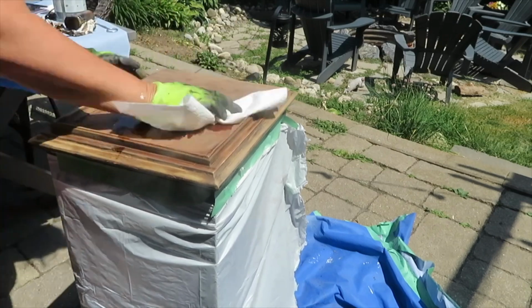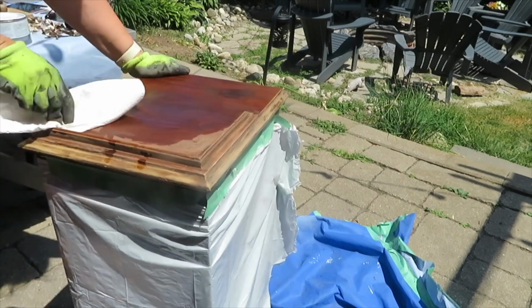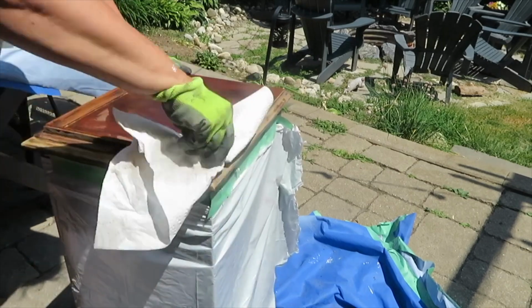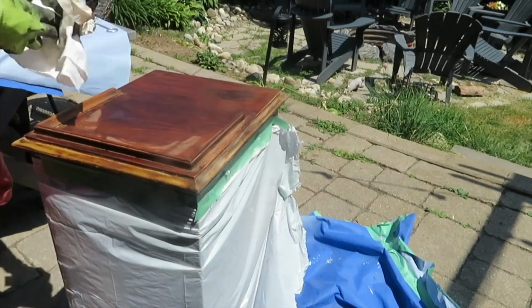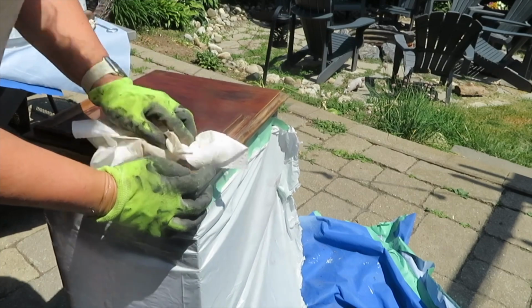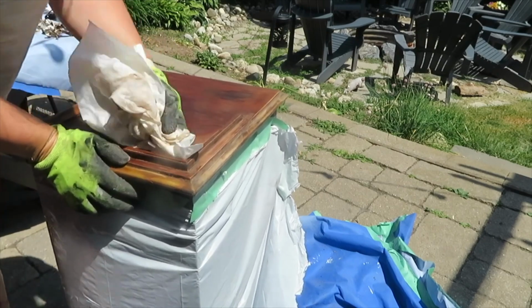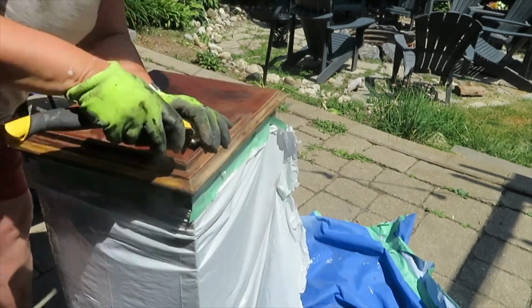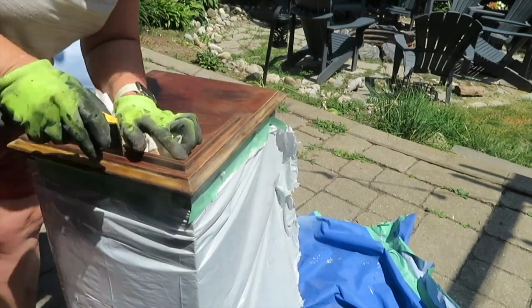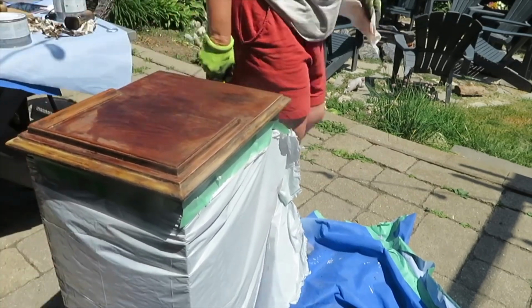This is a great way to clean your wood, and it does a little bit of conditioning too. If you don't have a wood conditioner, a good one is equal amounts of mineral spirits and wax, and that will condition your wood as well, if that's something you're looking to do. I don't typically condition my wood, but maybe I should.